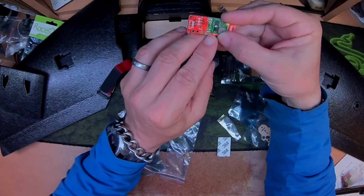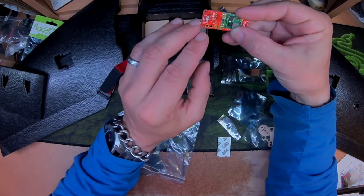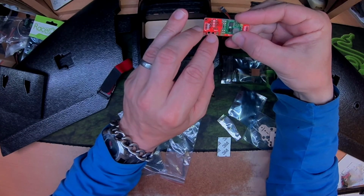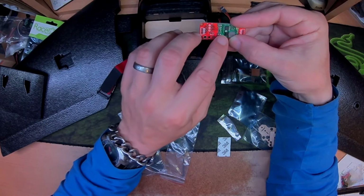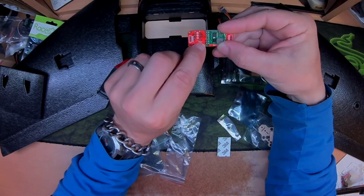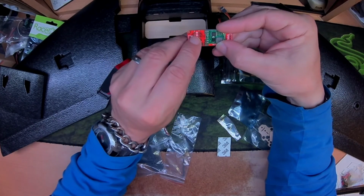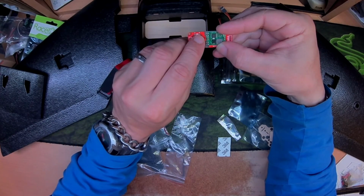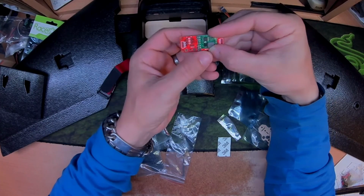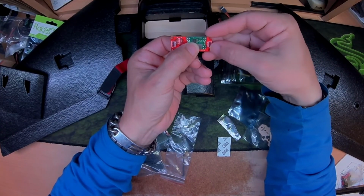So it looks like this is your positive pad, your negative pad, and it looks like you can take VCC out from there, and this will process 5 volts back to here's a 5-volt header. You would put A and B servo into here, and then it will route it out to here, providing power or routing it all through.